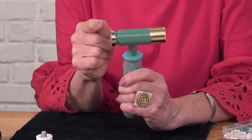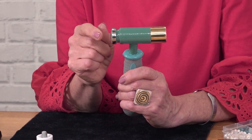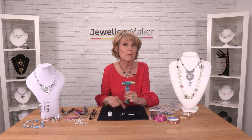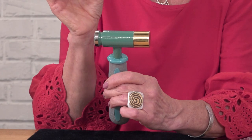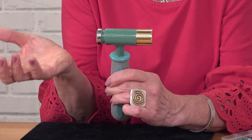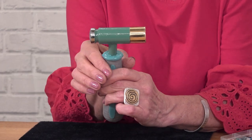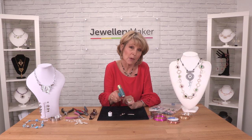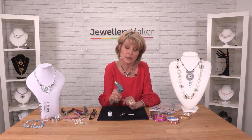I found that the chasing head of a metalsmith hammer was the best. But metalsmith or silversmithing hammers have much longer handles. If you want to hammer a tiny piece of 0.6 wire, for instance, you need to control exactly where that blow is going to go. That's the reason for this short handle — you can really put the hammer and place that blow where you want it.